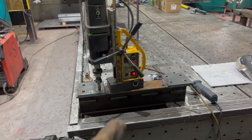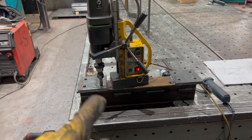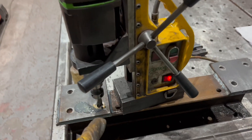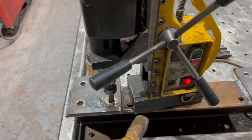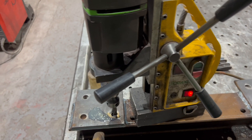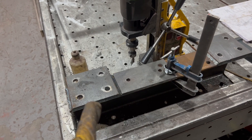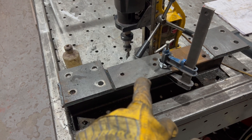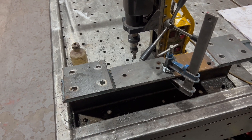I'm just using the mag drill here to drill these holes through. I punched the holes in these plates, welded them on, and then I'm using them as a guide to drill the holes through. There's a step here, so I'm just putting another plate on top of that to bring it up level — to make the base level for the magnet. I've put another 10mm plate there with a clamp, and then I'll drill this hole out.